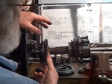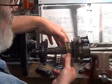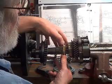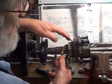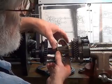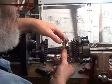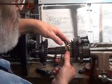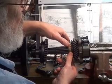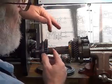The next thing is this brass piece — this is the synchronizer ring and it acts like a brake. This part of the hub is tapered, and so is the inside of the synchro ring. It's the synchro ring that's brass, that's soft, that can stretch and wear out — and that's what causes crunching when you're putting it into gear. You have the same thing on second, third, and fourth.